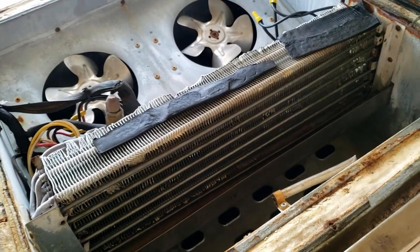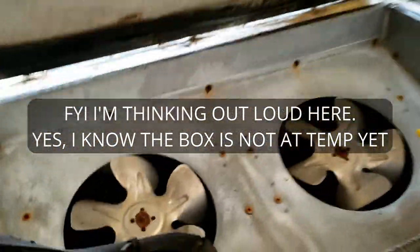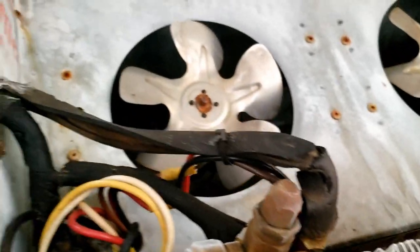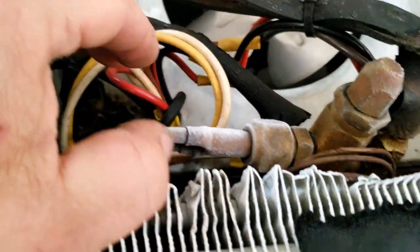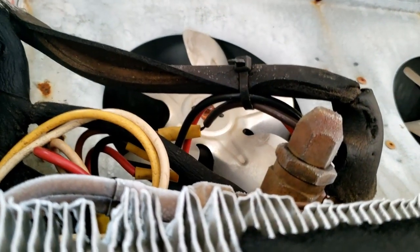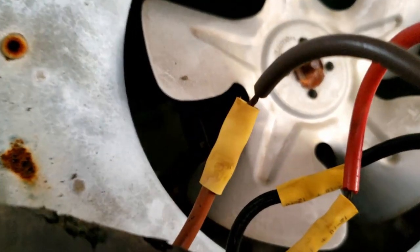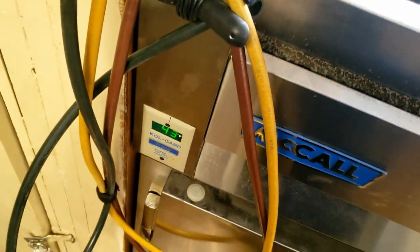Look at that — they're not running. There's just no switch. It could be the fan delay too. We've got defrost termination on it — that's not dangerous or bad, that's actually nice. But whoever did this wiring didn't know how to use a crimper — these are poor-looking crimps and none of them are tucked in. We're currently getting down to temperature, we're at 43 degrees.